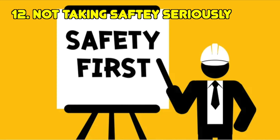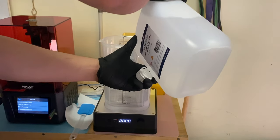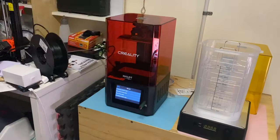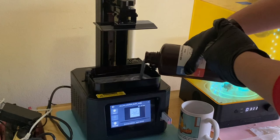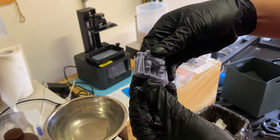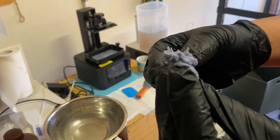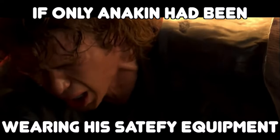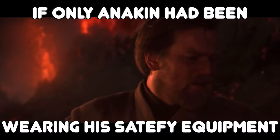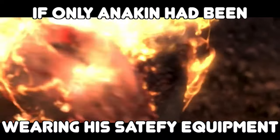Next mistake, and quite important for our health: not taking safety seriously. When printing we're using chemicals that aren't safe to get on our skin or breathe. I remember not using a mask on the first day I was cleaning prints and had a headache for two to three hours. Get a respirator and buy nitrile gloves — resin can burn your skin, especially if you get it on you and then go into the sun, as UV curing resin is an exothermic reaction. Wear safety glasses when removing supports, as you can get uncured resin flicking into your eyes. It's better to be over cautious than to regret not taking safety seriously.